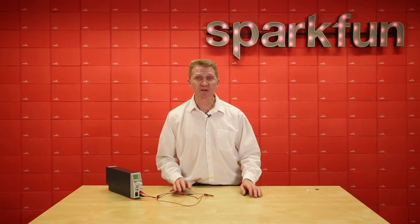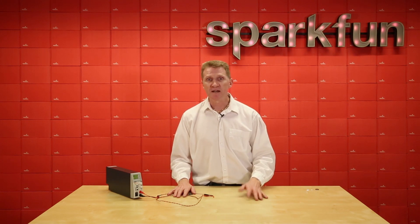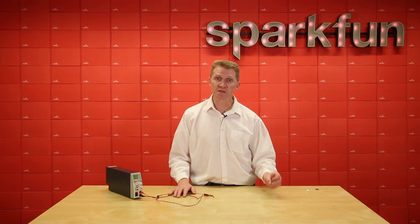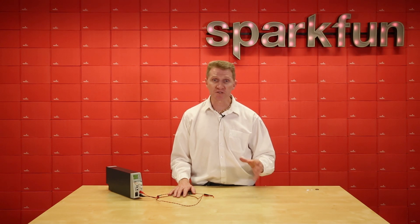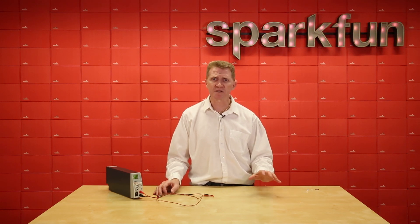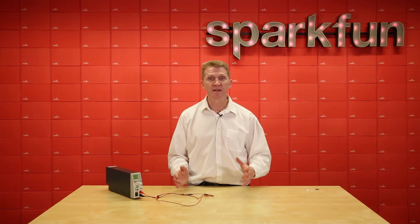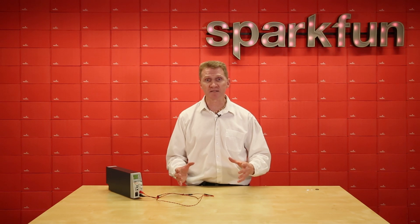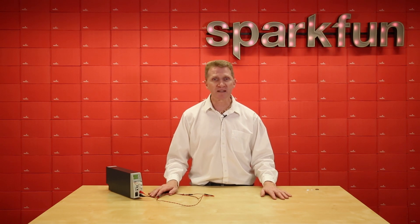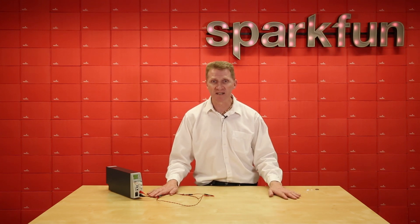We're talking about power and resistors. Your datasheet is going to be your best friend when adding these into a circuit. A datasheet is going to tell you things like forward voltage and current — the amount of forward current it needs. Voltage may also be called voltage drop, same thing. It's going to be 2 to 2.4 volts usually, and blue, violet, and some others are going to be a little more, maybe 3 to 3.2. Your datasheet will help you figure out, especially if you're using multiple LEDs, what kind of current and resistors you need. There are some great websites — there's an LED wizard that we will link in the description that I use all the time if I'm using multiple LEDs from a single power source.